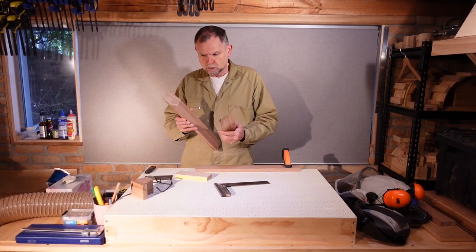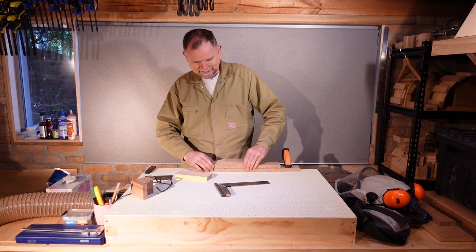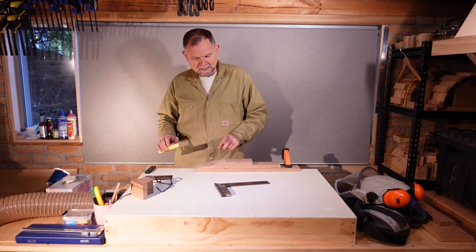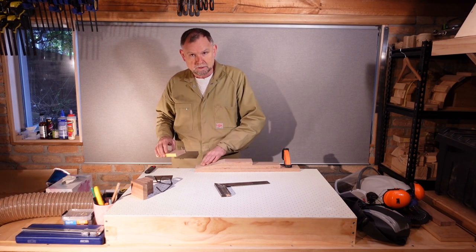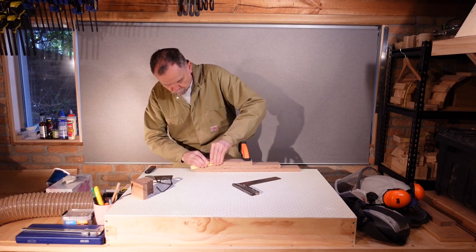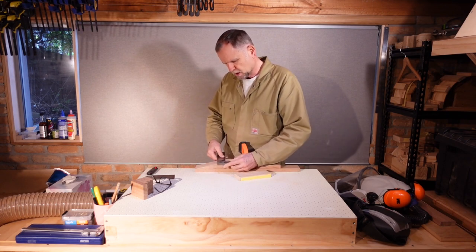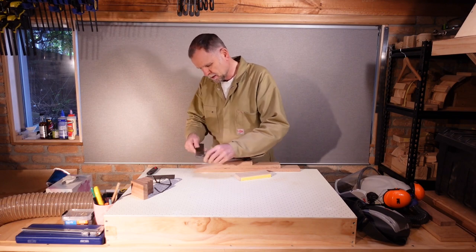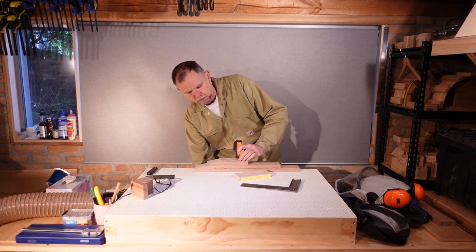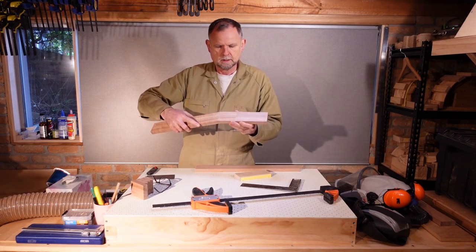The cut is not perfectly square and there's a little bit of blade burn. So what I'm going to do is clamp these two facets together and sand them with a block until everything is perfectly square. I must take a great deal of care not to crown these faces. I'm now quite confident that these edges are nice and square. My set square shows that each transition is square and also that we have a nice straight line there. That means these are going to join together nicely.